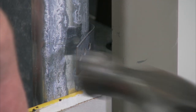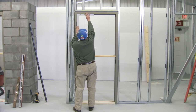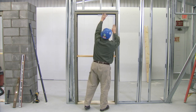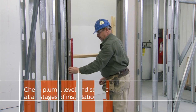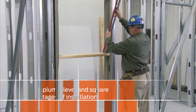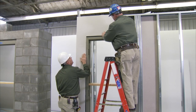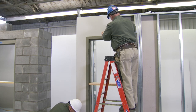When using wood stud anchors, be sure to bend the ears tightly against the stud. After the frame is secured to the studs and tightly anchored, it should be checked again for trueness in all directions. If the opening requires it, verify electrical wiring needs. When the drywall installer arrives, the installer should check that the frame is plumb, level, and square before hanging the drywall. It is the drywall installer's responsibility to avoid excessive shoving of the drywall into the hinge, strike, or head jambs and throwing the frame out of alignment.